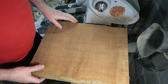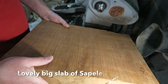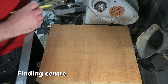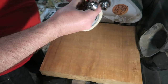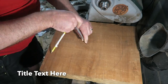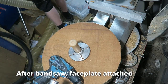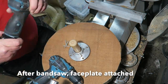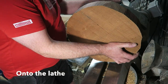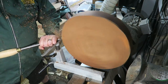The starting point for this project is this lovely big slab of sapele that my friend John Walker gave me. It's a beautiful big lump of wood. I'm just finding the centre here and making up a makeshift compass out of my dividers, just marking out the circle. I then took it over to the bandsaw and then it's a case of putting the faceplate on it. I have a bit of a love-hate thing with sapele — it really produces some lovely pieces but I'm not keen on the dust or the smell.